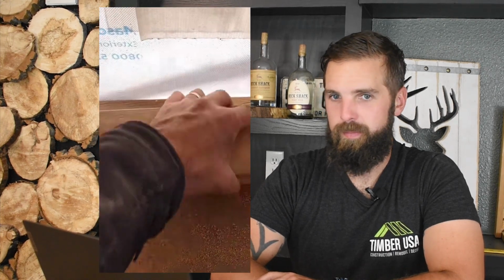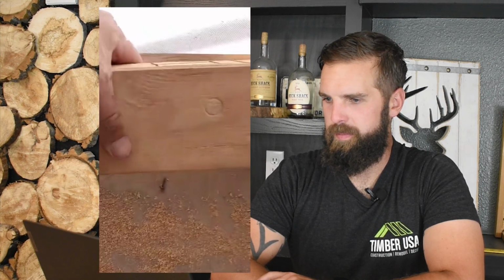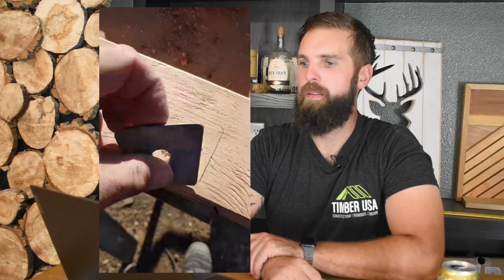Here's a building hack you might not already know. Here I have a bolt that's stopping my block from sitting flat. I'm not going to waste my time measuring. I'm going to hit the block and mark the location of the bolt that way. And then I make the recess with whatever tools I have on hand.